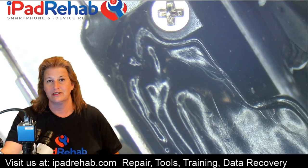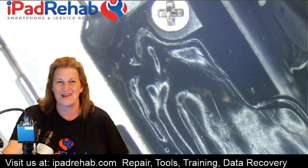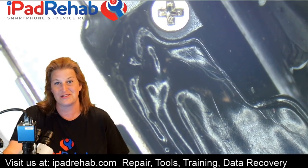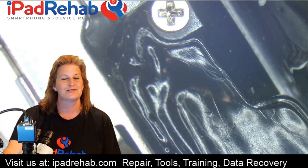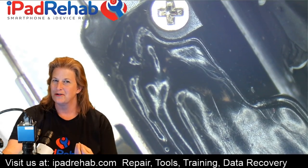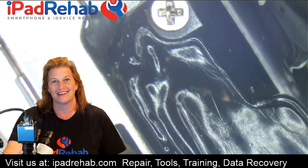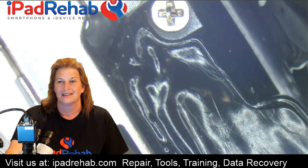So that's it — I just wanted you guys to see what microwave damage looks like and have that on your radar screen. Some of us find it hard to imagine anybody would do this, but kids will do anything, and the internet teaches hard lessons about skepticism. If you see a phone with no obvious water damage, a vague history of 'just stopped working,' multiple shorts, and very focal but very severe damage to plastics melting in spots correlated to antennas, Wi-Fi, or RF functions — hand it back and say we can't help you. That's what I'm going to say on this phone.